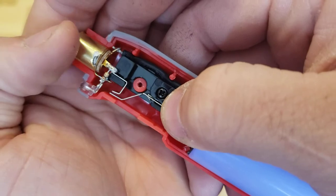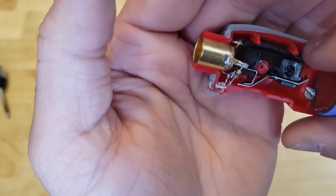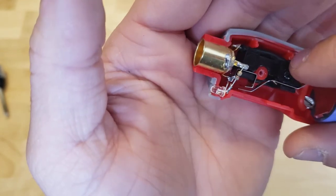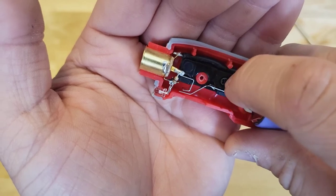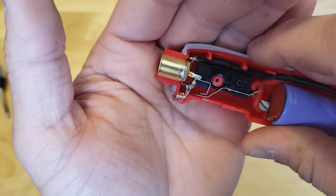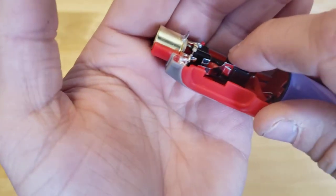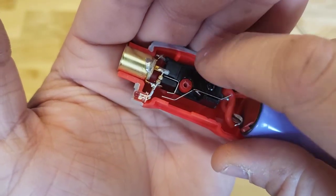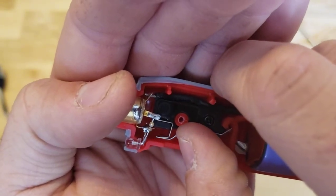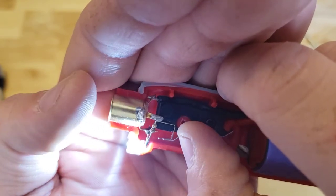So you can see this flexible piece of metal, which is held in by this plastic piece. I can't tell that this is any sort of device other than a plastic piece that holds these components in. It doesn't look like there's anything going on in there — I could be wrong, I haven't removed it. But as you can see on the side, it looks to be just a hollow plastic piece that holds it. Essentially when you push this thing down, it makes contact, the LED comes on and power is allowed to transfer through.